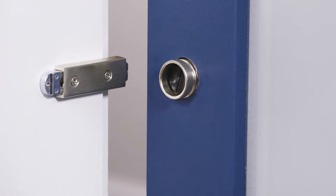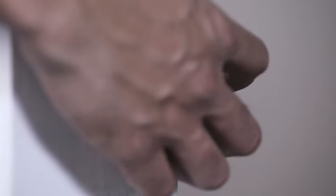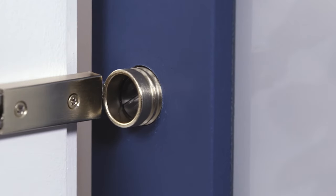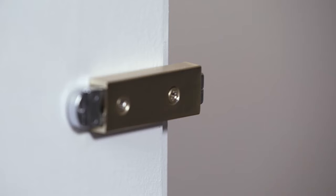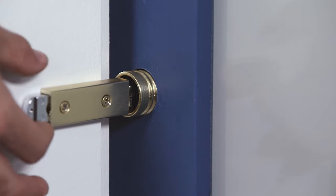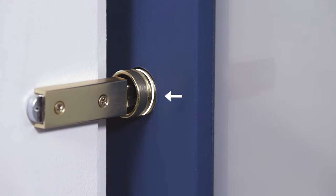You'll complete the hole from the other side to ensure the wood doesn't split. Then install the strike through the door with the flange pointing away from the latch. Next, retract the latch bolt by pressing it in, then slowly close the door and make sure the strike does not collide with the retracted latch bolt. If it does, hold the strike flange while twisting the strike cylinder clockwise to shorten it until it no longer collides. Then extend the latch bolt by pressing it in and releasing it, and check that the latch bolt sufficiently engages the strike, making note of which groove is closest to the door surface.